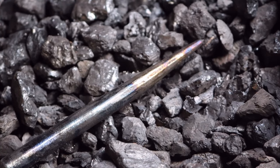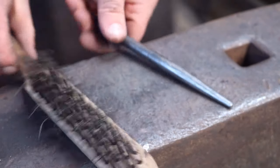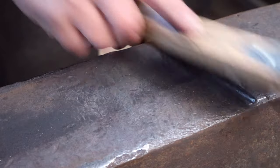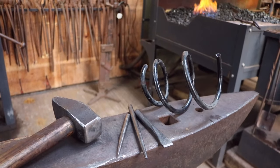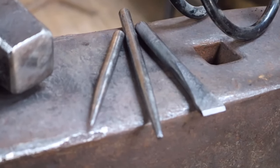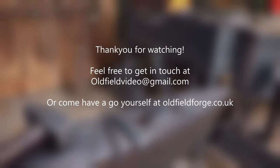As you can see on the punch here, the colours start from where it was hottest and migrate down towards the working end. Apologies for my camera work here, I'm still learning. And once your tempered tools have been cooled down, feel free to keep those colours or brush them off — they are entirely aesthetic at this point. And there we have it. If everything went to plan, you now know how to turn a coil spring into basic blacksmithing tools, and hopefully learned a little bit about heat treatment along the way. If you've enjoyed this little lesson on basic blacksmithing, feel free to subscribe. If you have any questions or recommendations, feel free to comment down below or email me at oldfieldvideo@gmail.com. Thank you for watching, and I'll see you next time.